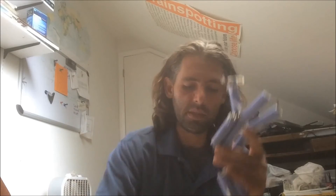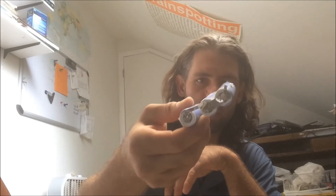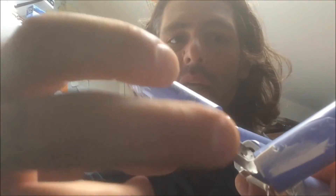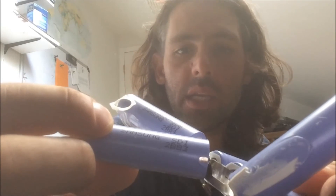Nine probably perfectly good Samsung high capacity 18650 cells. I've got a group here — it looks like three in parallel, so it should read around 3.6 to 4.2 volts if it's fully charged. Reading 4.2 volts. So this is another one where the charge controller on the circuit board went bad — maybe the power supply brick surged. But the cells are in really good condition. I did nick the casing of one cell, but I didn't dent it, so I'll just wrap that in duct tape — it's going to be just fine.